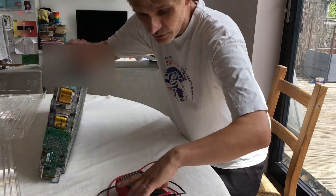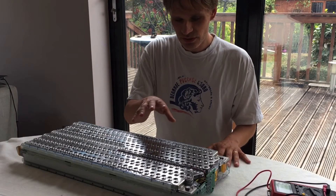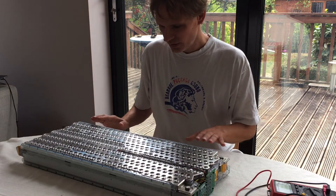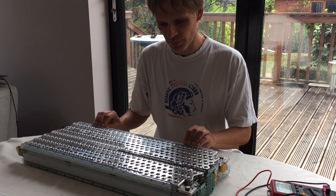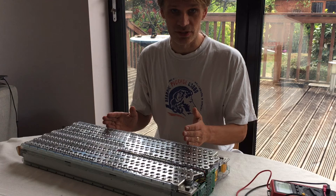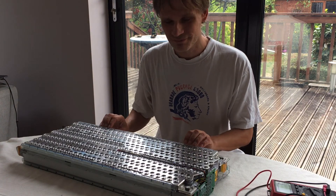All of those groups of batteries are within 3 millivolts of each other, which is a pretty well-balanced battery — certainly nothing to be worried about. So we've checked the voltages and these six groups are pretty well-balanced. We've done the visual check with no discoloration, and we've checked all the individual fuses. Because these batteries are pretty robust, you can be very confident this is a good sound battery. We will do the check of the capacity it can hold in the next video, but that takes a little bit longer. For now, I'm going to put these plastic coverings back on to protect the battery and make sure none of these plates get shorted.